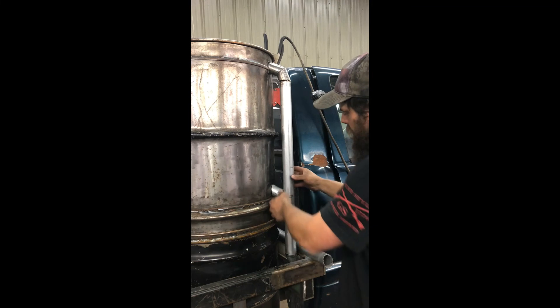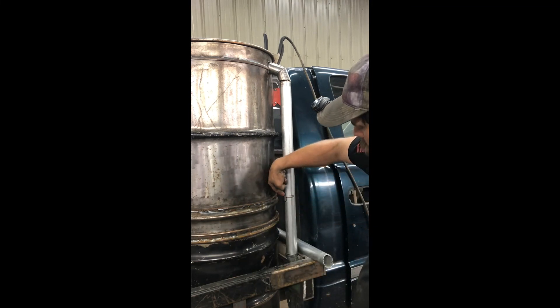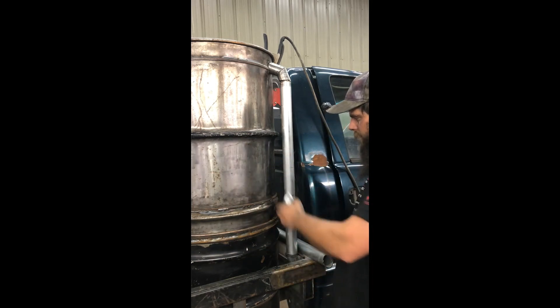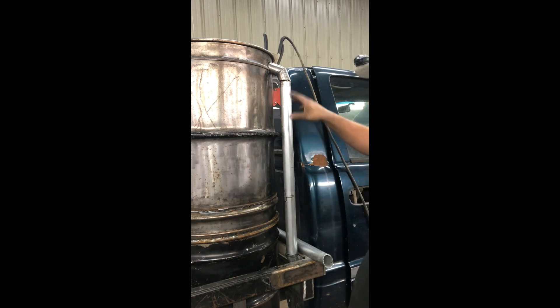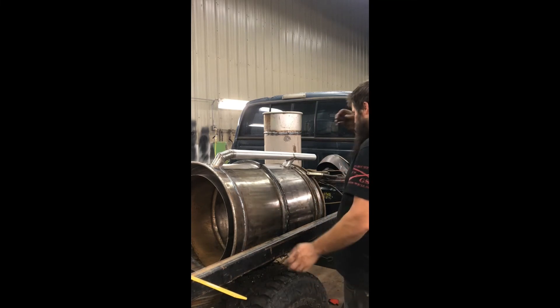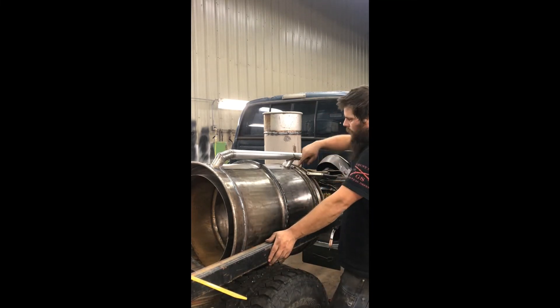Of course, I need to get in here and cut out the hole into the bottom gutter, and then cut out the hole going into the drain pipe. Then this guy can get welded in. The tar drain pipe is all tacked up and ready — I can pull it off and fully weld it. I ground all the galvanizing off, got it fully welded all the way around both sides. The holes are nice and flush into the bottom of the gutter, so they're going to drain really nicely.